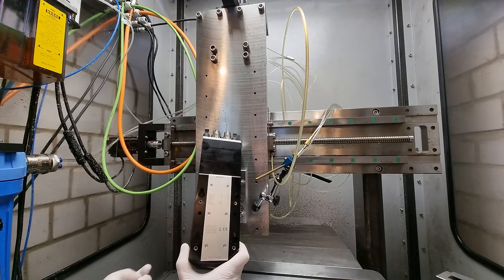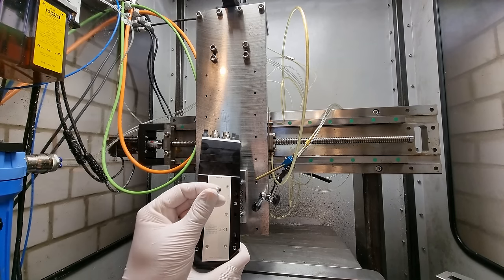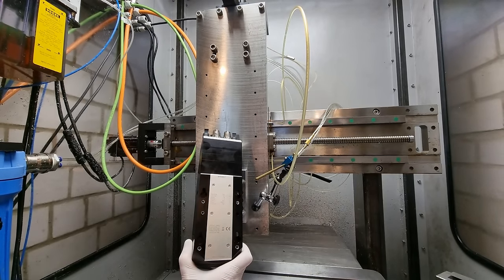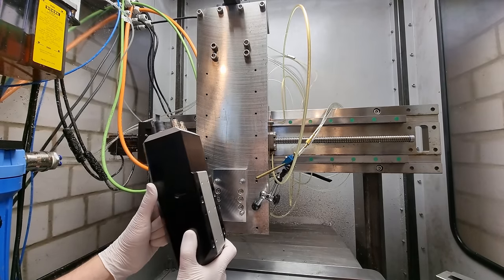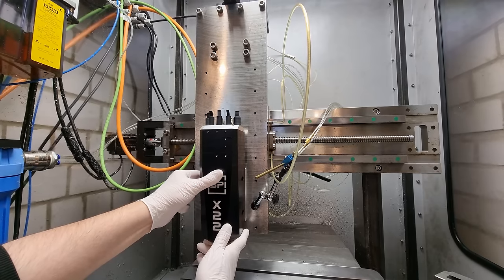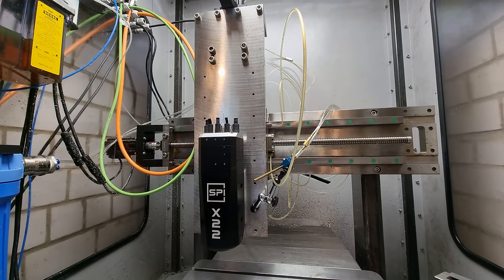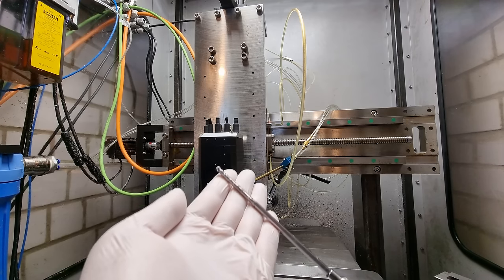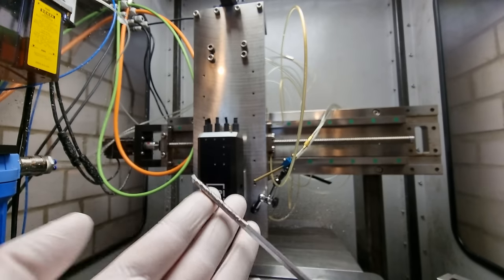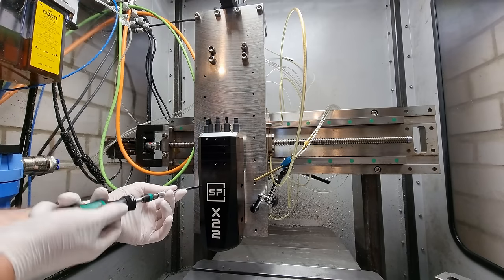The X22 has four rear threaded holes for through-plate mounting bolts, two blind holes for included precision-ground hardened alignment pins if you're planning forceful maneuvers and don't trust pure bolt pressure, and four keyhole slots with which the spindle can be mounted conveniently even if only accessible from the front. As soon as the spindle has slid into position, the mounting bolts are accessible through sideways holes and can be tightened with a spherical Allen key. The tolerance of this cheap Allen key that was included with a 3D printer didn't quite fit, so I modified it tastefully.